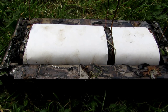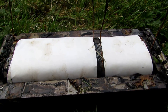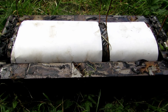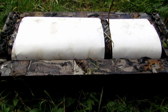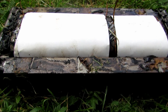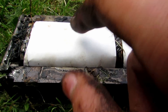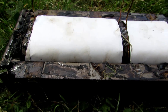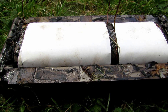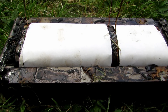If you wanted to do this, as long as you have two transformers, you can take apart one, find out the turns on the primary, and mess around with the turns on your secondary or vice versa. You could get high amperage transformers or really high voltage transformers. That first one which I messed up and had to remove the whole secondary coil - I'll actually probably rewind that with some nice fine wire and create a 50,000 volt transformer.